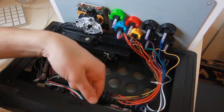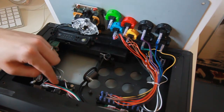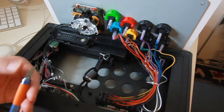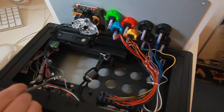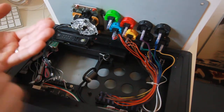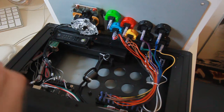As you can see, they're labelled with the corresponding buttons. So all you have to do is simply snip these from the old board, cut them off, peel them apart from the ribbon — they come apart very easily — and take one wire at a time into the corresponding terminal on your new board. This is when I use the craft knife, extremely sharp, sharper than a Stanley knife. I rolled the cable across the blade until it got through the rubber, then pull it off. One consideration: the wire inside these ribbons is extremely thin — three to four strands maximum. The hole at the bottom of the terminal is rounded where the screw goes in, but the bottom of the screw is flat, leaving a small gap. So you have to roll or fold back some of the raw cable to pad it out, giving more surface area and contact for the screw to grip as you screw it down.